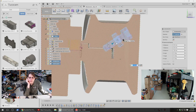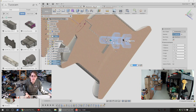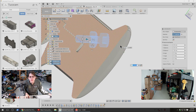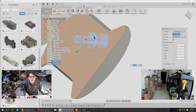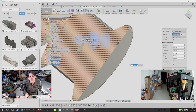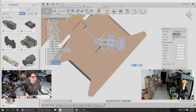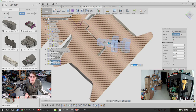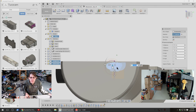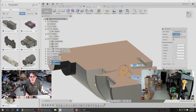Oh, and Alfie is saying, instead of a nut, what about a proper threaded insert? Mostly because for it to be strong enough, I couldn't put it in through the same side as the bolt, because then the bolt would just pull the threaded insert out. And to put it in the other side, I'd have to go through this whole shaft, which seems really annoying. So yeah, I think what I want is a slot to put the bolt in through this side, and then...